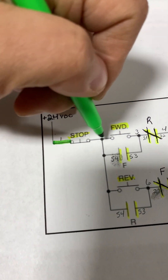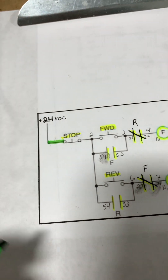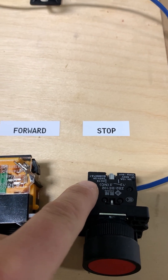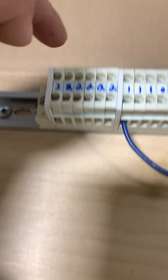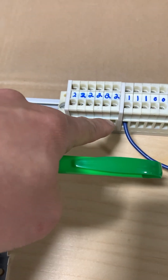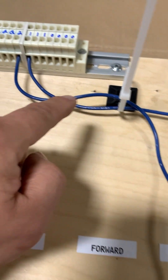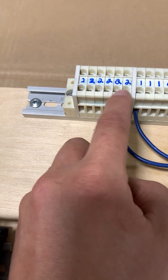Next we're going to move to wire number two. Coming out from the stop button, wire number two parallels out to four locations. I'm not going to shove four wires into the stop button, so I'm going to send one wire from the stop button over to this terminal block. All the terminal blocks labeled two are jumpered together so they share the same common. So I'm sending a wire from the stop button to the terminal block labeled number two — since these are jumpered together, they all share the same potential.